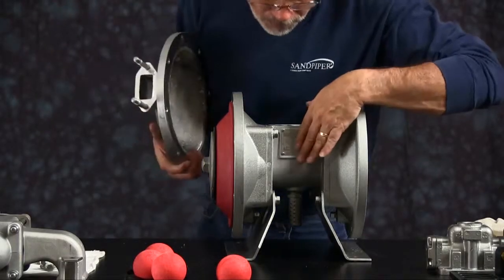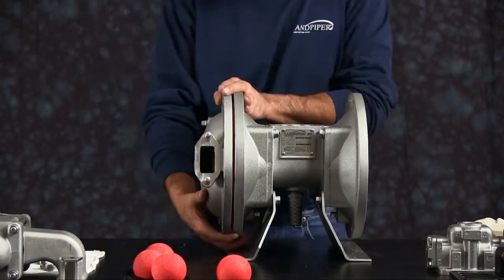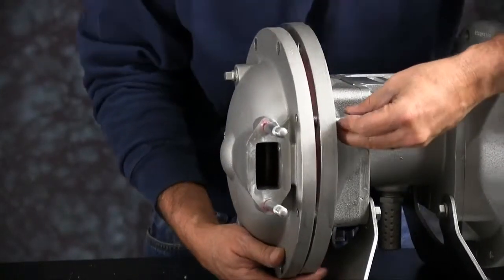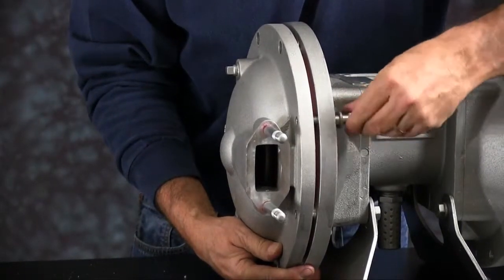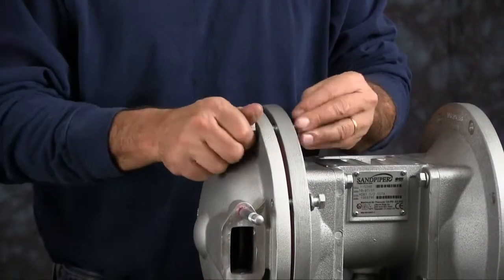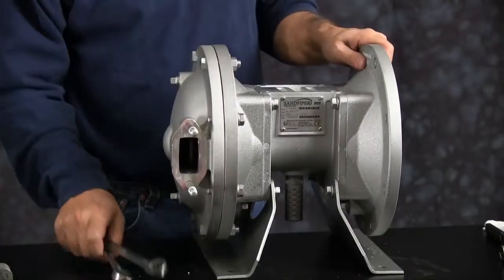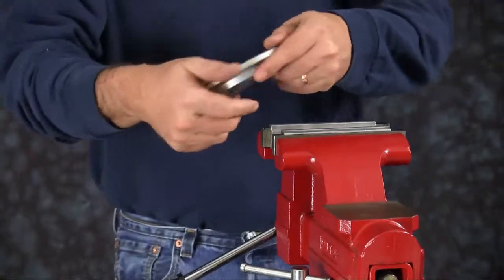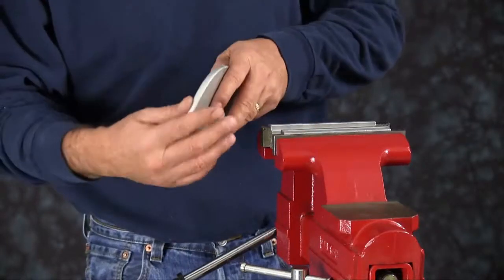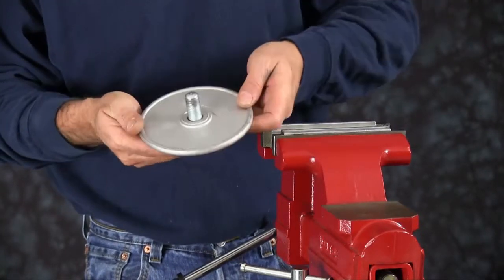The port side of the chamber faces in the same direction as your nameplate. You want to install the two blind-hole bolts first — this will hold the chamber in place while you install the rest of the bolts. Go ahead and install the rest of the bolts and tighten them down in a crossing pattern. Inspect the inner and outer diaphragm plates. Ensure the plates have no sharp edges or scarring on the radius. Plates can be cleaned up with emery paper, crocus cloth, or fine sandpaper. Make sure the radius is maintained during cleanup; replace if necessary.